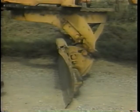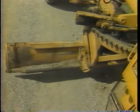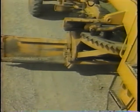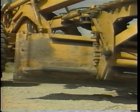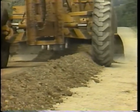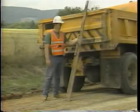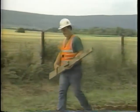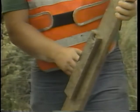Next, spread the windrow. Set the blade forward at the top and angle it to pick up and spread the windrow from the center toward the edge of the road. Adjust the position of the blade parallel to the cross slope. Spread the windrow evenly to form the proper cross slope, then continue reshaping the subgrade on the other half of the road. To check the cross slope, use a camber board. The camber board measures the fall of the road surface from the center line to the edge — this is called the cross slope of the road.